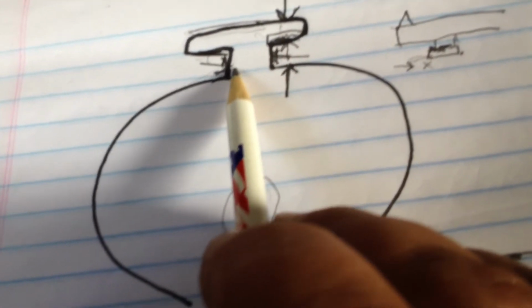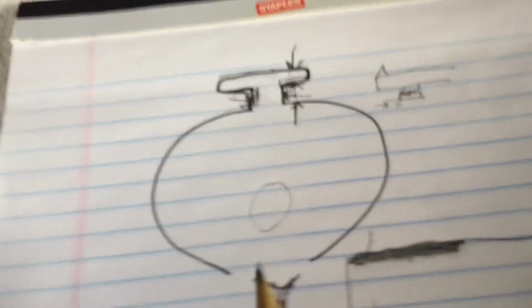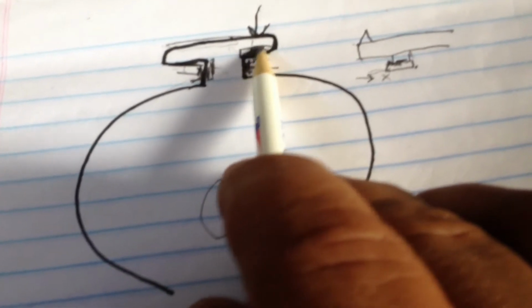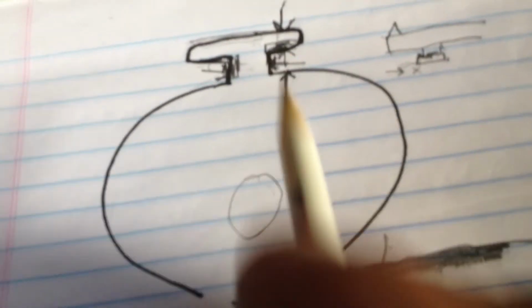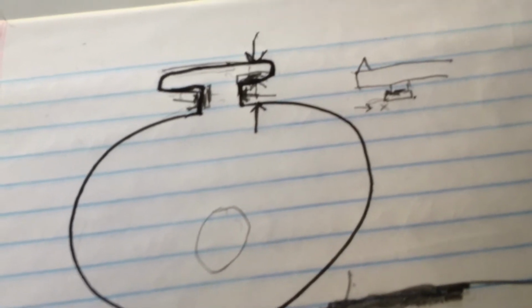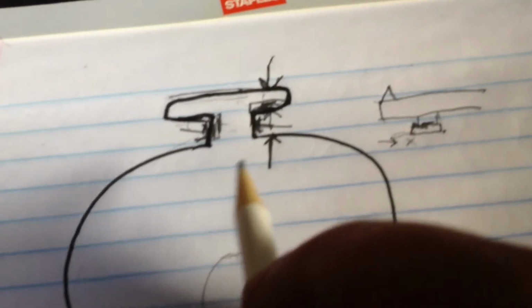If you're taking off metal where it's not necessary here, when the bayonet is on, it's going to flop around. So it is possible that this might also have to be relieved a little bit. I think I might have done just a touch on mine. Once I got this done and it was sliding on good, the little bit of resistance I had left might have been that this just needed to be relieved a touch. I don't even think I hit it with anything crazy abrasive. I think I just hit it with the fuzzy wheel with a little compound on it to polish that up. I don't really remember.